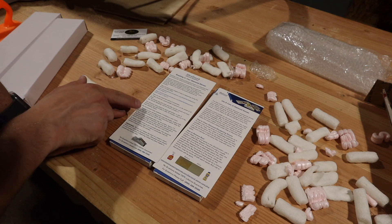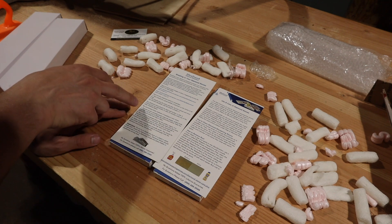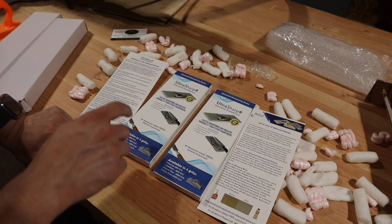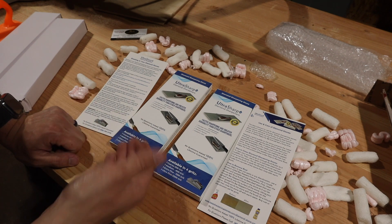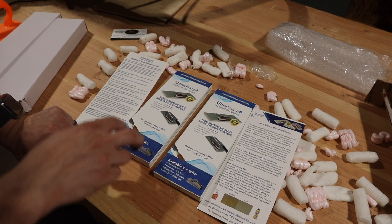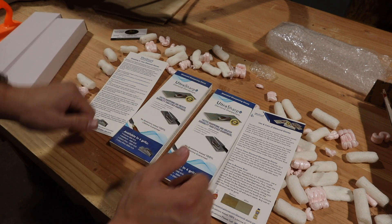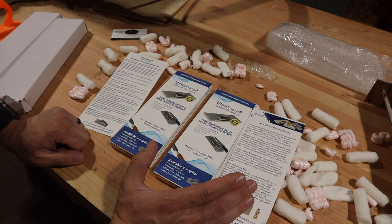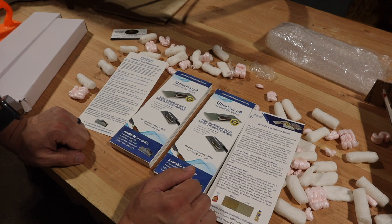In my particular case, I'm going to be sharpening as I normally would. Rather than using a plane blade or a chisel, I'm going to take a hatchet and sharpen it on the 2200 grit and then the 3000 grit. The reason I'm going through just these two — as opposed to my normal process of 300, 600, 1200, and then 2200 and 3000 — is because I want to get some good wear on these to break them in. I don't care if my hatchet ends up in a perfectly even shape; I mostly just want to break these guys in, and it'll be way sharper than it normally would be.